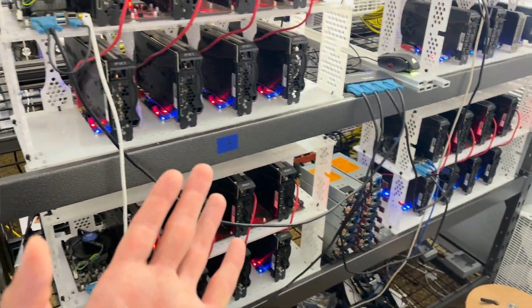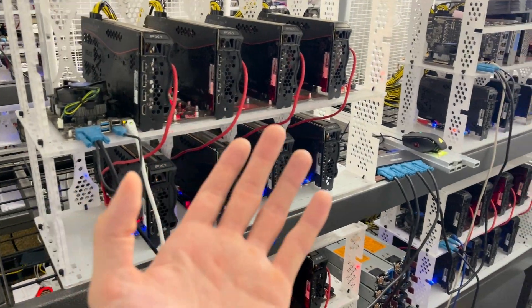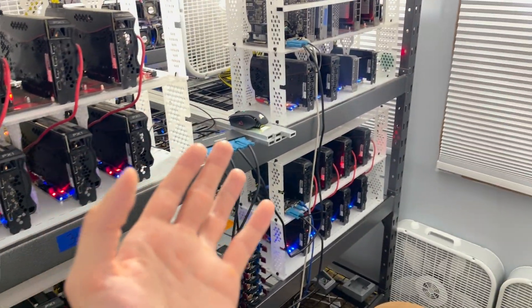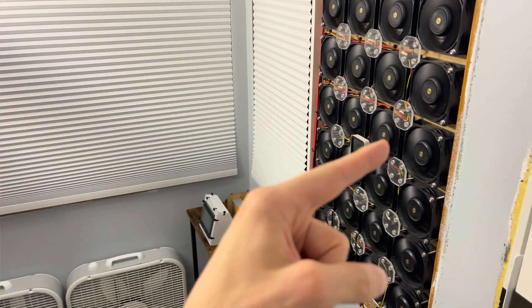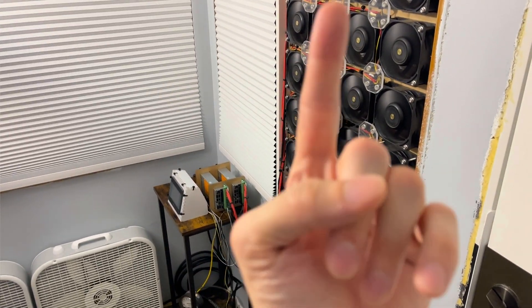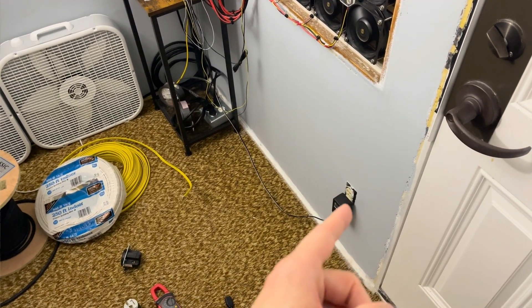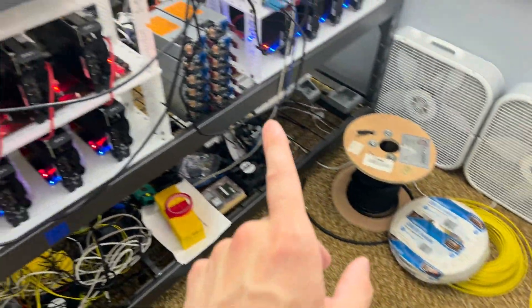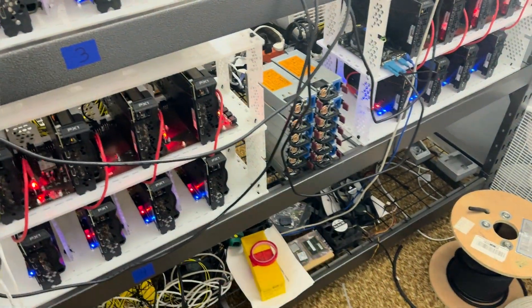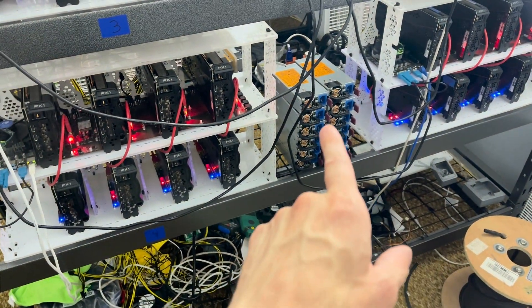Hello travelers. A lot of people find mining to be quite the technical challenge, and it tends to be beyond a dozen or a few dozen GPUs — it starts to get real problematic. There are two main areas: cooling, which I talked about in other videos I'll link up here, and getting the power in — getting enough power out of the wall. So today we're going to focus primarily on the AC side of things, getting the power from the mains into your power supplies.